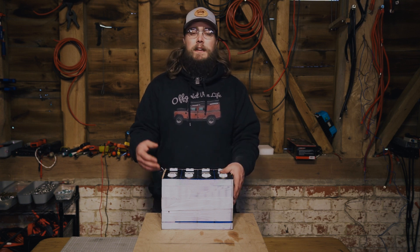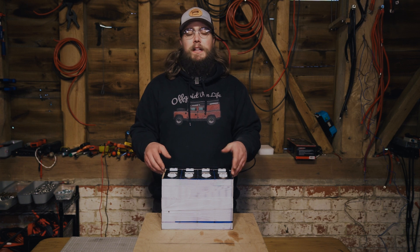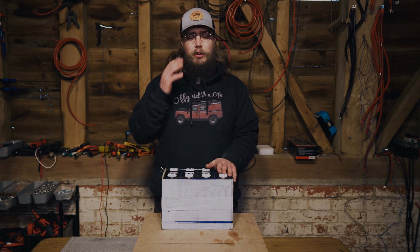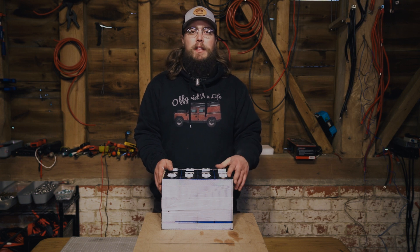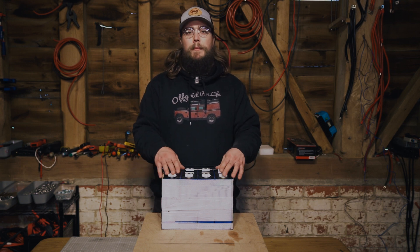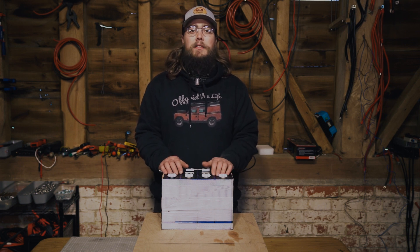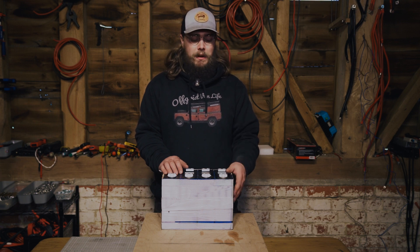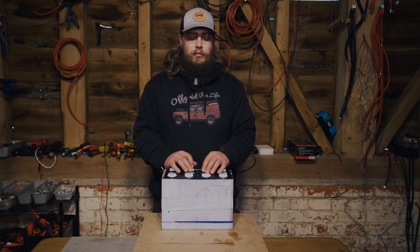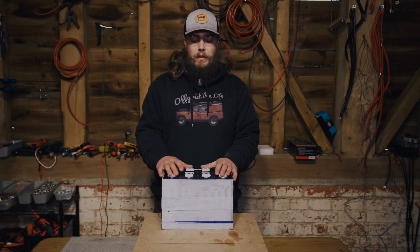The most important thing when building a lithium iron phosphate battery is to be very careful not to short anything. Beyond damaging your cells, it's a massive safety issue — things like wearing rings while working or not wearing eye protection are very dangerous with these cells. If you do happen to damage or short them and there is any liquid coming out, you cannot use that cell anymore. Dispose of it appropriately and do not use leaking cells, as the liquids can be fairly hazardous.